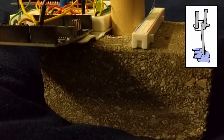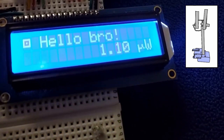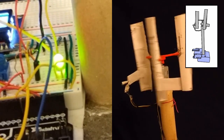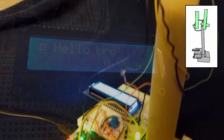On this brick is where most of the electronics are housed. A microcontroller manages all the wiring logic. On the LCD screen, we can output the generated power in microwatts, used to gather performance data. A green LED turns on to indicate when the turbine is producing power — essentially detecting when the power output is not zero microwatts. Looking back up, there's also an LED and a photoresistor, implemented as a way to measure the rotation speed of the turbine, where the photoresistor can tell when a blade blocks light in its rotation.